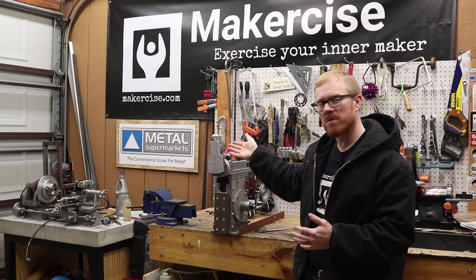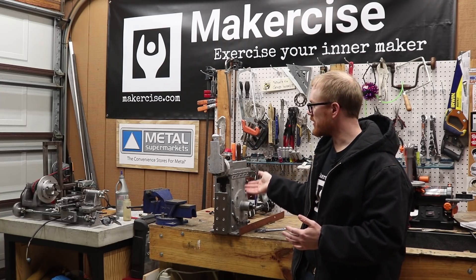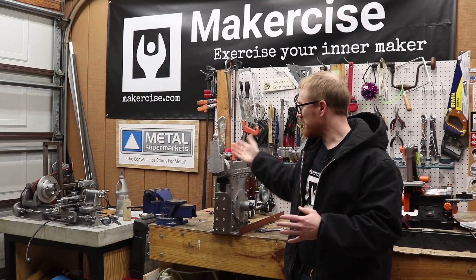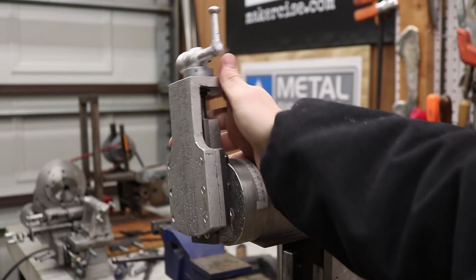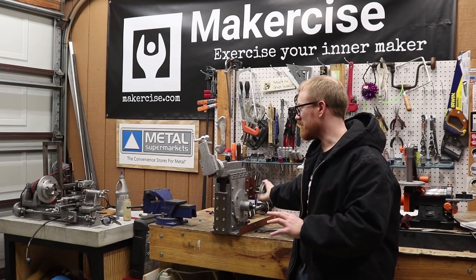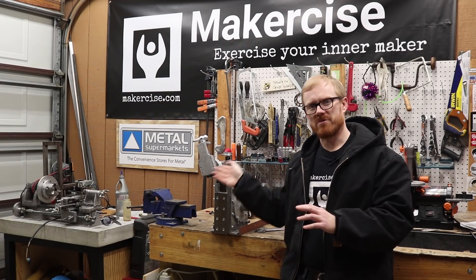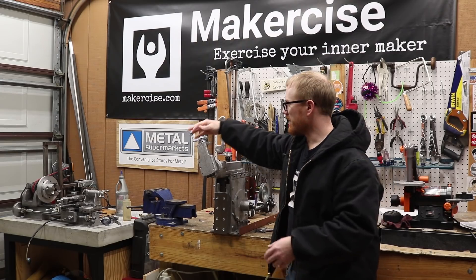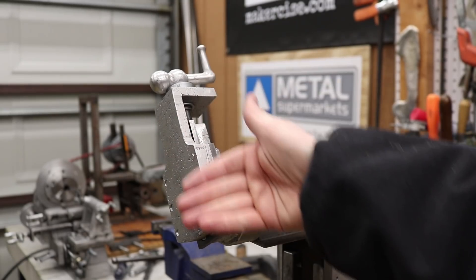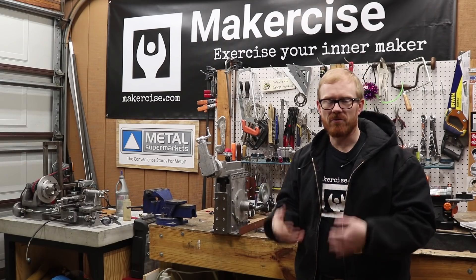In this episode, I'll be completing the downfeed for the Shaper project. The downfeed allows the tool to go up and down on the rotating head, so you can adjust the angle for a dovetail. During that whole cutting operation, the Shaper is doing its reciprocating motion to shave off material while you kind of manually advance the cutter down the surface of a dovetail, for instance.